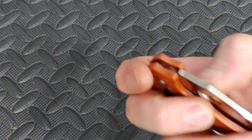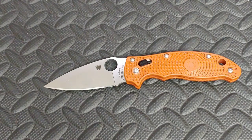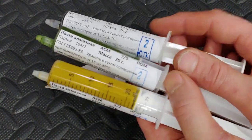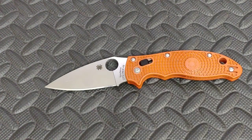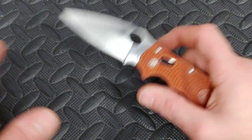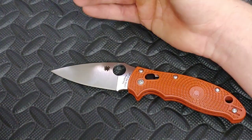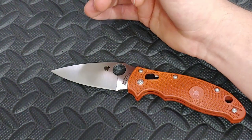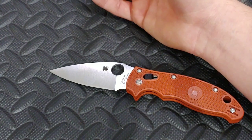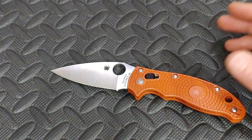And the other day, I did this knife right here. I sharpened it, I even did it on a video. And then I came back across it with some diamond compounds, which I'm still practicing with. Now, I have some other compounds just like this. They come in a little bit smaller tubes, but they're aluminum oxide, so they don't have the bite that these ones do. I'm really liking these though, and the aluminum oxide is fantastic too. It doesn't last as long as the diamonds though. The one downside to the aluminum oxide paste is that it wears out over time. So I'll be able to strop, I don't know, 3-4 knives, give or take, and then I'm going to have to reapply the paste. Now, I could probably get more than that, but I'm just saying.